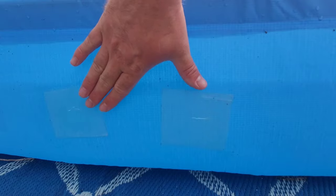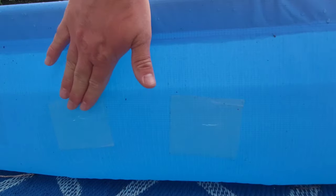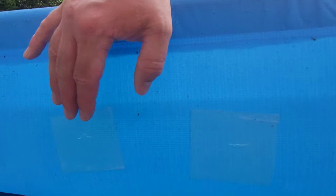It's now been a week since I patched these two spots. The one with just Flex tape is still leaking a little down at the bottom — not as much as the beginning, but still leaking. The one with Flex glue and Flex tape is not leaking at all. Not all pool liners are the same, but this combination will absolutely stop a leak. I'll leave a link in the description. I recently also checked out another pool patch device called Plugs It, and I'll link that review, along with my original flex tape versus gorilla tape video.